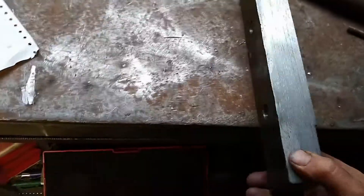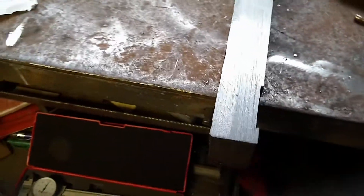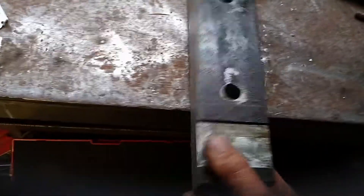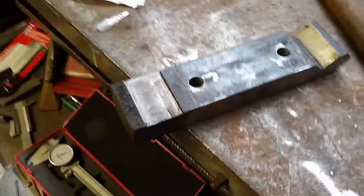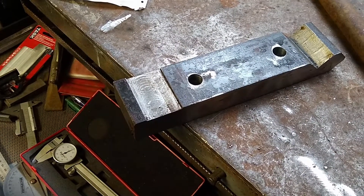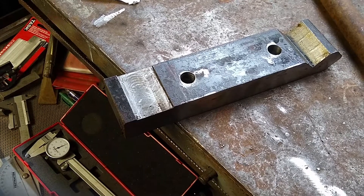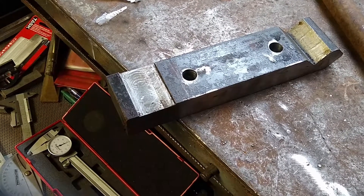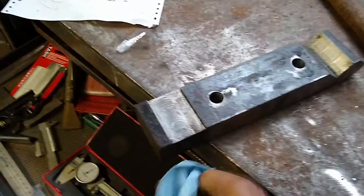So I spent a day working with the shaper. This is the first side I was playing with, and I switched to the other side, trying to get this square. This is going to be for my — what are they called? It's called a traveling rest. It's for the lathe, right? It's going to go sit on the bed of the lathe, there's going to be some bolts through here, and we're going to put a big round thing on here with three wheels.